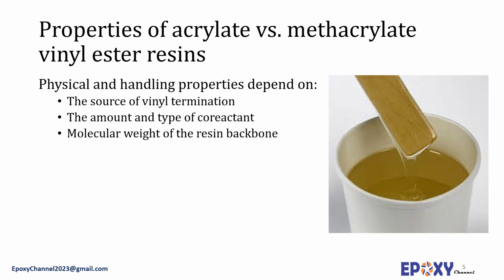The acrylate vinyl ester resins are more susceptible to hydrolysis than the methacrylate vinyl ester resins, and thus are not generally used in applications requiring premium chemical resistance. Conversely, acrylate vinyl ester resins are preferred in radiation cure systems because of their greater reactivity. Undiluted vinyl ester resins vary from semi-solid to solid and therefore utilize both reactive and non-reactive diluents to provide workable viscosity levels and enhanced reactivity.